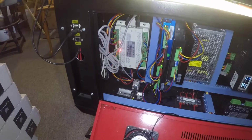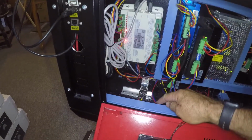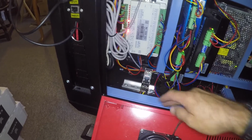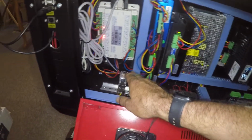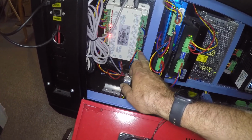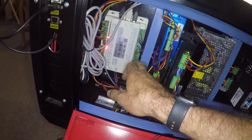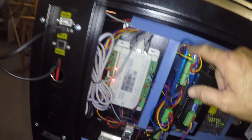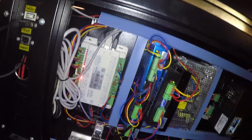Okay, here's the final setup. We have the relay mounted. All right, wires going in through the channels, up, around, and up out into ground here. 24 volts up here. The door protect switch is there, and the two wires for the alarm are up here.